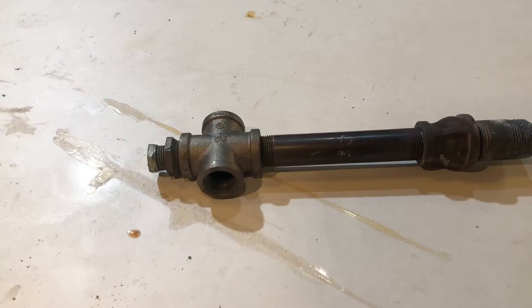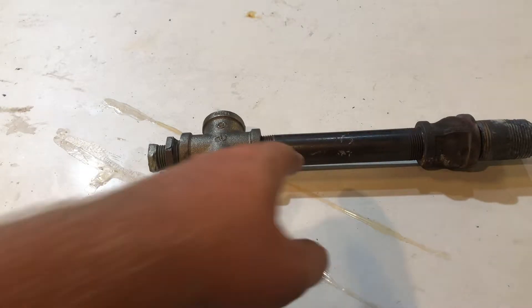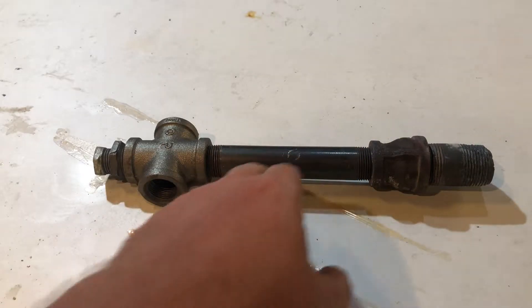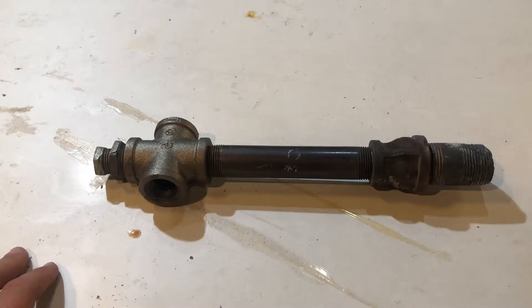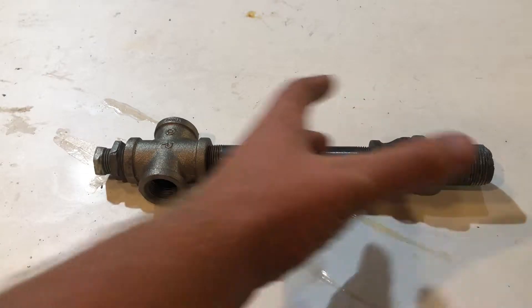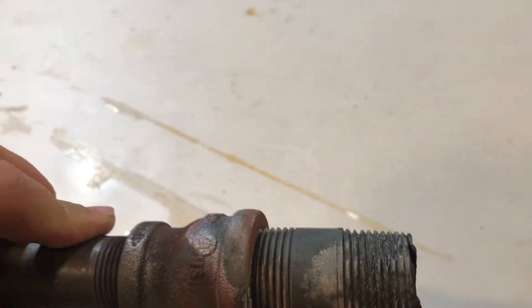The Venturi is the easiest part — simple black iron and galvanized plumbing fittings. Don't use galvanized if you can find black iron, or if you do get them, leave them in vinegar overnight to strip off all the zinc plating. These do get hot — with my infrared they get up to about 700 degrees up at the nipple, and around 180 further back after running about two hours straight.